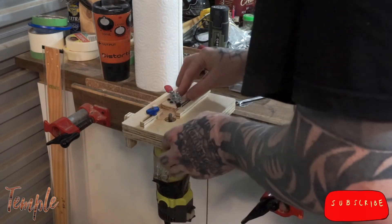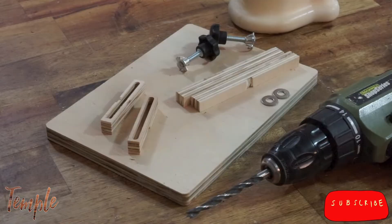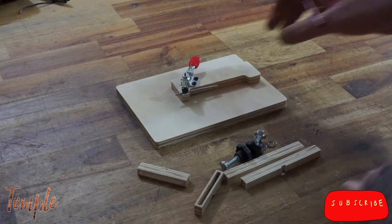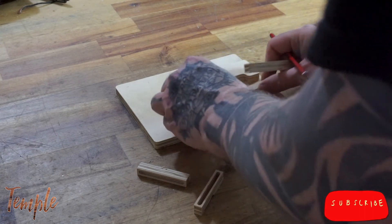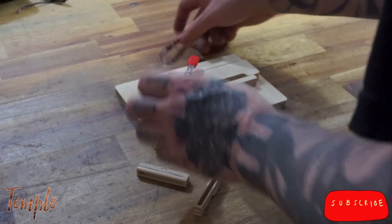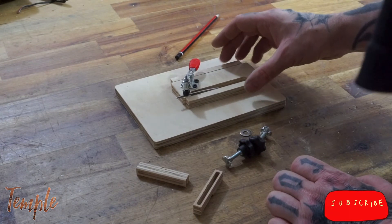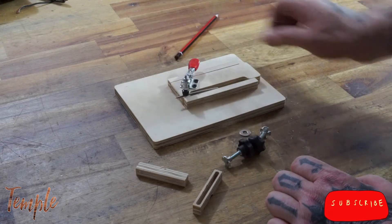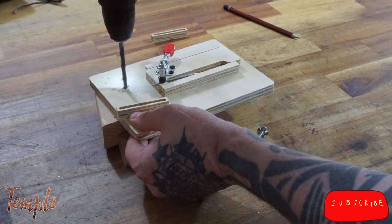But in order to achieve maximum efficiency, we need to make the reloading jig. We already made the parts, so this is going to come together really quickly. Just like in the CAD drawing before, everything starts with our fret holding jig. We add a couple of rails in exactly the same way that we did them before. And if you thought that last jig was easy, this one's going to blow your mind, because it doesn't have to interact with anything outside of itself, like the cutter on the router. So you can position your parts anywhere that you like on the board.